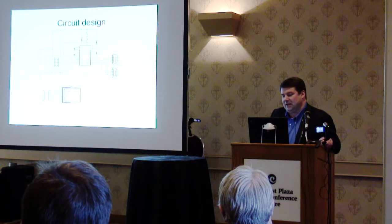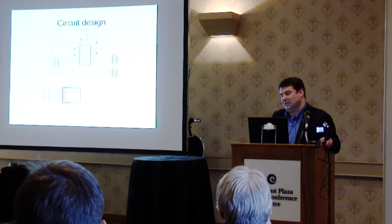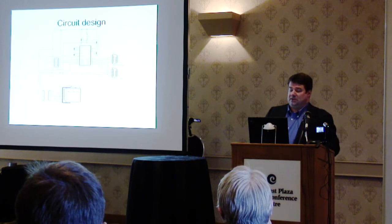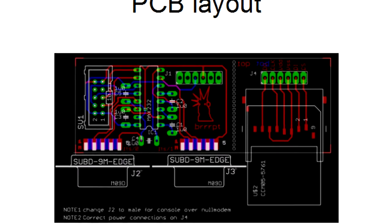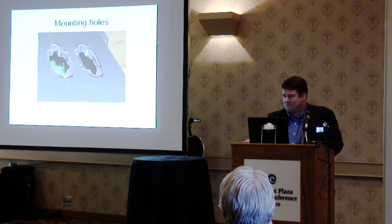What you see here is a level-shifter chip that takes the 5 volts from the circuit board and converts it to the 12 volts used in the RS-232 communication standard. We've also added a socket for an SD card to expand the memory of this device. That's what the circuit board layout looks like on the PCBs I designed. All of these source files are available on my website. Then it came to deciding where to put those RS-232 connectors on my wireless router.